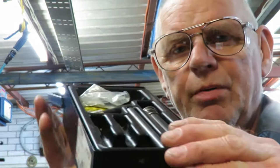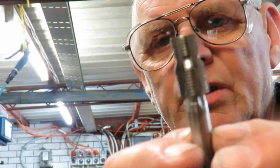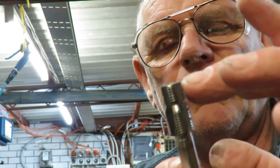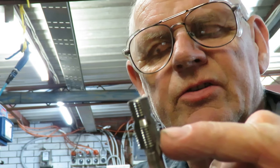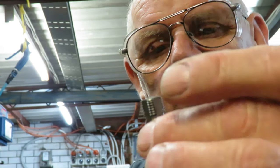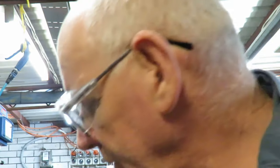It comes complete with all the tools. This kit is a 12 by 1.25, so it's for spark plug repairs — one of the sizes of spark plug repairs. It comes with a tap which can screw into the existing thread, what's left of it, and it then reams the hole and cuts the main thread for the insert. So you don't need to drill a hole — it guides you through, providing that thread hasn't been pulled out totally with nothing to connect to.